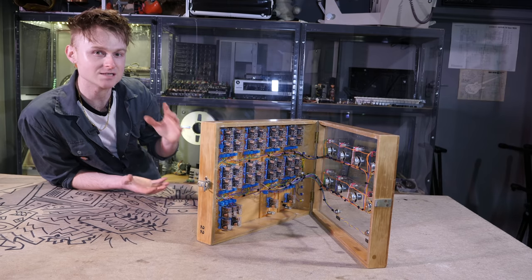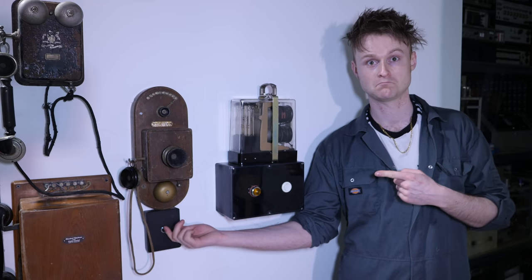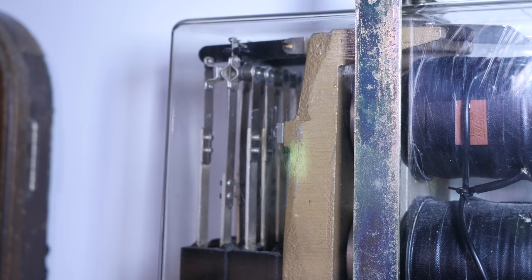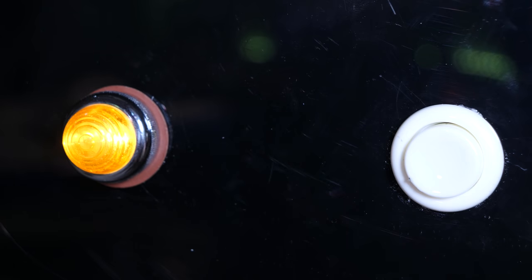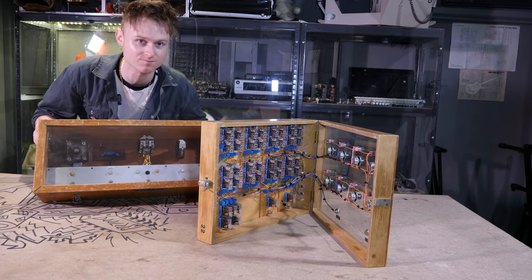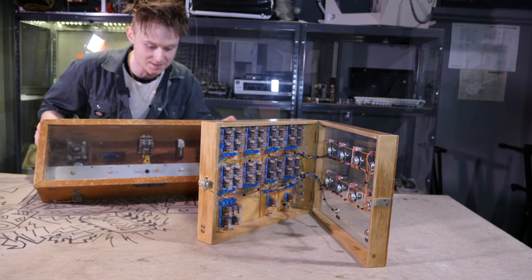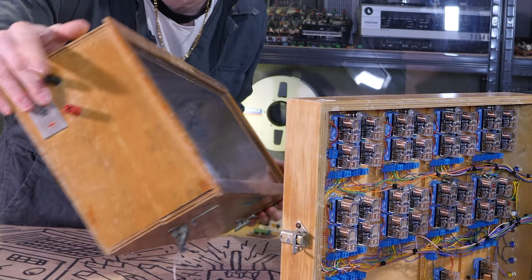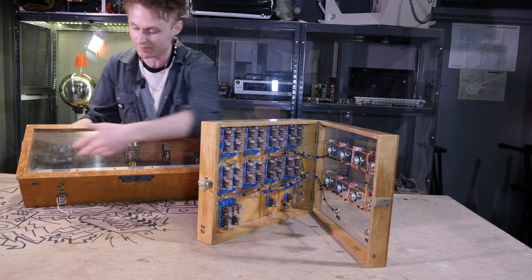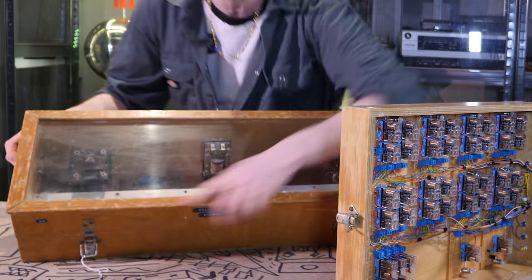In the last video, there was that massive relay I had. Well, I've now put that on the wall in the museum next to a couple of ringy bell telephones, so you can either ring the bells on the telephone or test the relay yourself. As you can see, if you push this button, it makes the contact and it lights this lovely orange warm incandescent panel light. I've still got to find a way of displaying this relay box that I think was probably from some sort of university or college, as a display part in a science class. It's got 24 volt input, but I need to probably make a box at the bottom so people can push buttons instead of having to put your fingers in that. Because if a kid puts their finger in the middle of that solenoid, that's probably the end of your finger off. So you don't want that.